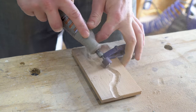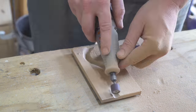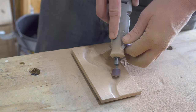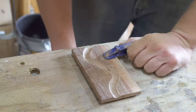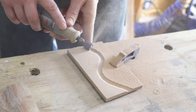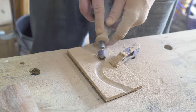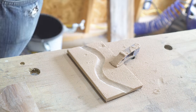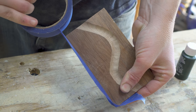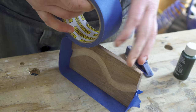The head of this mallet was going to have a river pour design on the side connecting the two epoxy ends. I decided to use my Dremel tool with just a drum bit, and this worked perfectly. It was very easy to control, and when it got to a certain depth it was a perfectly uniform width all the way across, making for a super clean sanding operation and a really beautiful river trough on the side of the mallet.